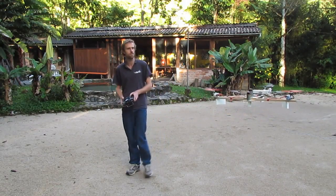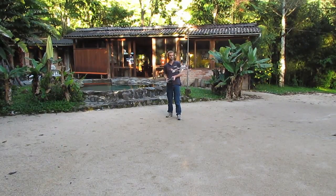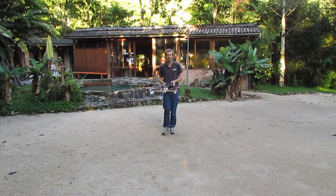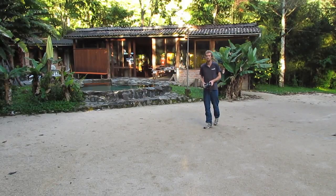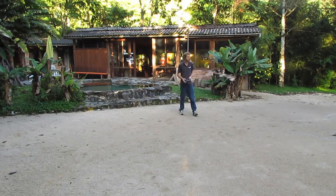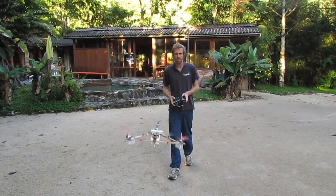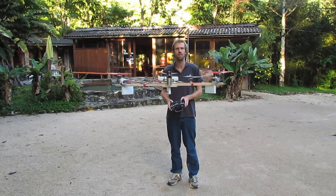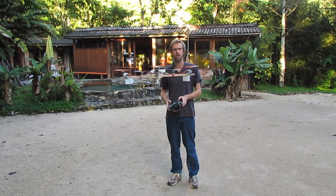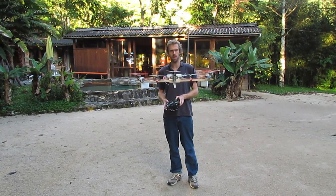This is great - I'm really happy with this. She hovers at just a little tad over half throttle which is nice. As far as centre of gravity goes, it's very estimated - what I've done now. But I am going to work on that. I want to get a slightly lighter battery, probably a 1800 or maybe a 2000 mAh 3-cell.